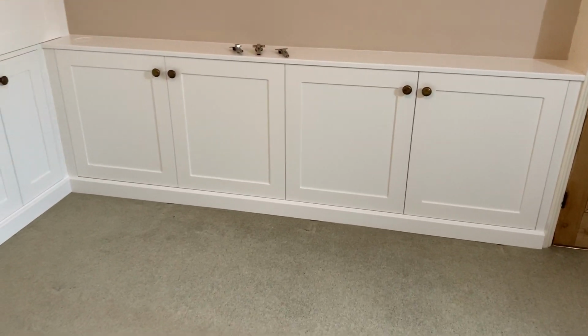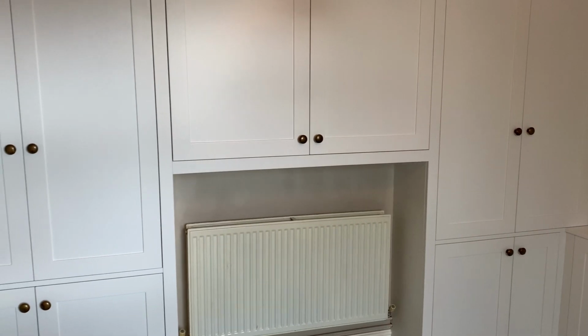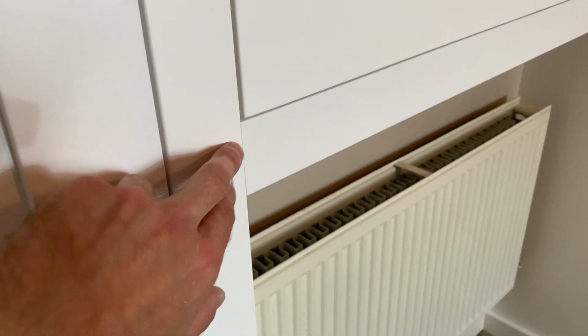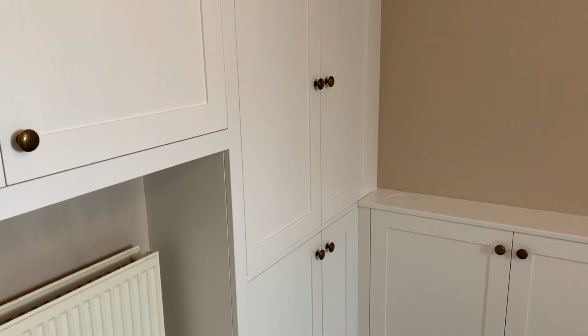We fit them, and just to give us a little bit of play in case something's not quite right, the face frame, it's not a true face frame. So we have these cover strips which we fit after the door. There is that traditionalist part of me that thinks, I suppose it's cheating a little bit, or it's not proper joinery, because a lot of these strips are fitted with very modern techniques using gap filling adhesive, also using dominoes, and so they're not strictly joined to each other where they meet in the same way that you would traditionally join. But then I don't know how you could get this effect by doing that. It'd be very difficult to have a one-piece frame.